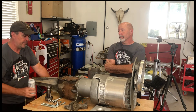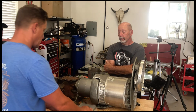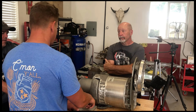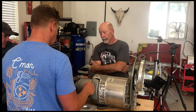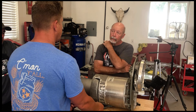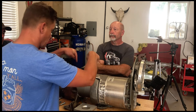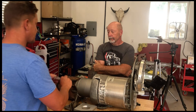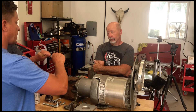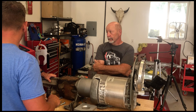The trouble I'm having right now is lining these holes up when I'm drilling — the holes aren't lining up. This hole doesn't have to line up perfectly as long as it doesn't hit the shaft. What we should do is get the TIG welder, tack these all together, and then take it to somebody who has a real press. The key is that hole has to be perfect — you can't have any flex, and you're not going to get that hole straight unless the pieces are attached to each other.